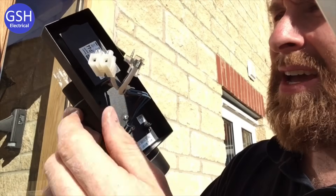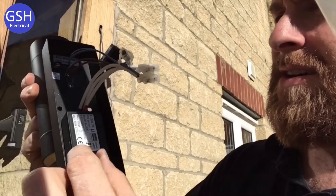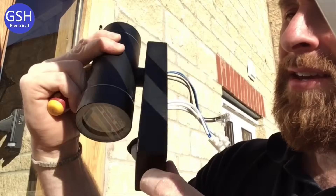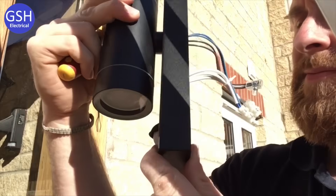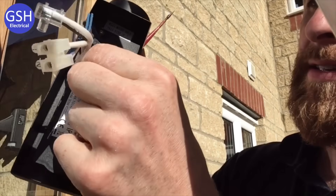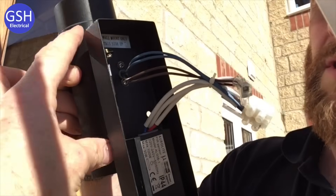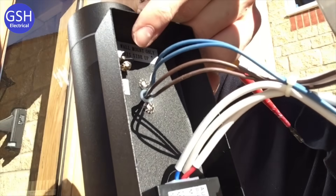On the back for all the wiring, we have two blue conductors — two neutral conductors — and two line conductors. The connector block here is for the line and neutral, which will just go on. The line comes in which feeds down into this little control box, which goes to a little PIR switch — a passive infrared switch, basically a little motion detector. As soon as that detects any movement, it operates a small switch in here, which then livens up this brown conductor connected to this little connector block, which goes off to the LED lamps. The earth connection is in the back here.